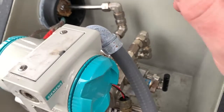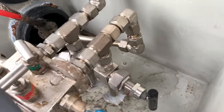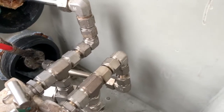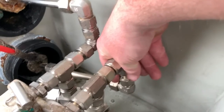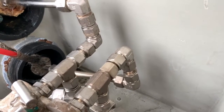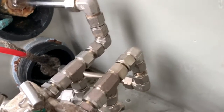Got called to the top of the boiler — there's a transmitter box that was full of water and it's dripping. I came up here to take a look. First thing, check the temperature; they're nice and cool, which means we don't have a leak down here. The pressure we have right now is over 1200 pounds — that's really high pressure — and our temperature is really hot.